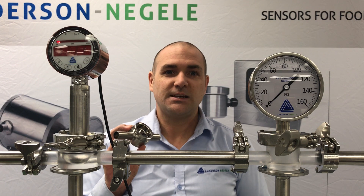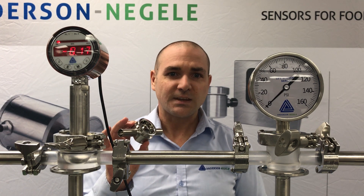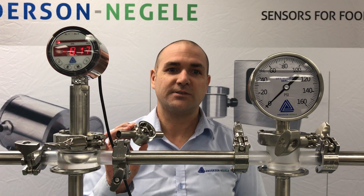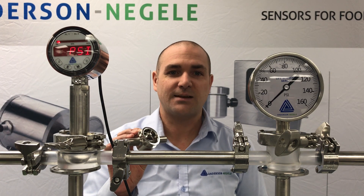we also have the ability to reduce the rinse times on your pre-rinse for your CIP. If you read the ASME BPE dead leg study that was done a few years ago, it shows that a branch length even equal to an L over D of 2 requires higher pump pressures and flow rates in order to remove air pockets in a timely manner.